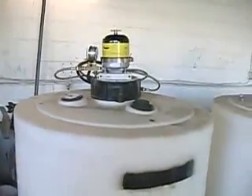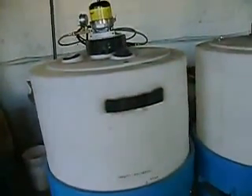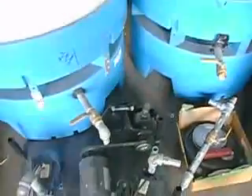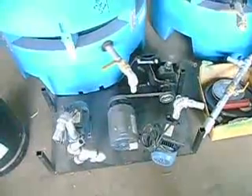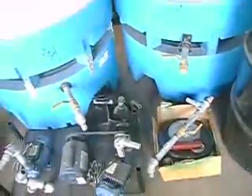Dieselcraft OC50 high-speed centrifuge. That goes into there and we can set it up to recirculate. Both of these have heating elements attached into the back — not sure of the wattage on them. GM power steering pump to power the pressure system for the Dieselcraft centrifuge. A couple of transfer pumps. That centrifuge pump drive is currently putting 85 PSI to the centrifuge. You can easily get the oil up to 180.